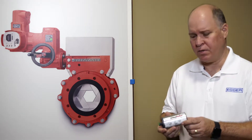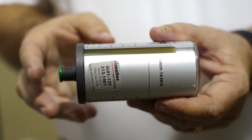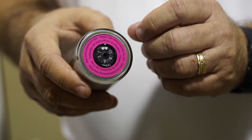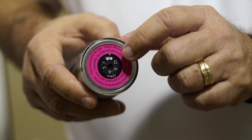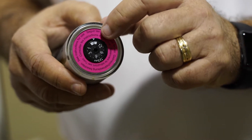The first thing we need to do is remove the plug. This will either pull off or you can cut it off with a knife. The second thing we need to do is set the dispense time to 12. To do this, insert a 3 millimeter allen wrench and rotate the indicator so that the 12 lines up with the indicator.